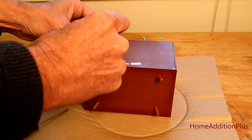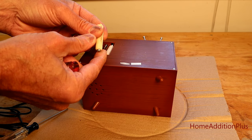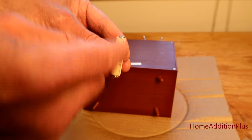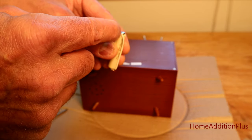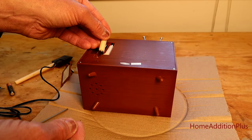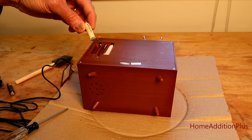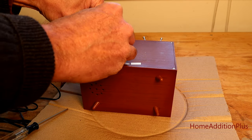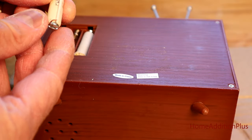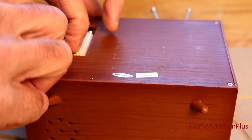There are a total of three batteries needed, so I needed to string these batteries together to complete the circuit. For the second and third dowels, I again made two pilot holes on either side, screwed in the screws, then wrapped a wire around each screw before tightening up. I placed them in to act effectively as dummy batteries, completing the circuit in series.